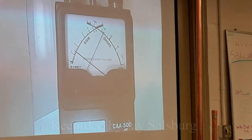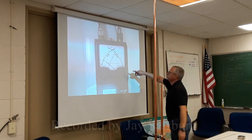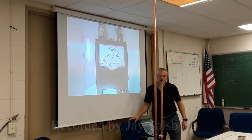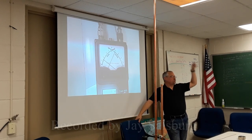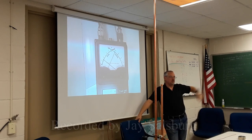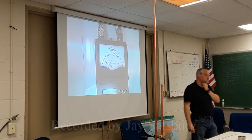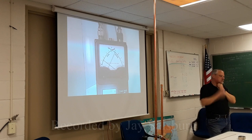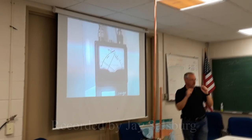And here's the deal, right? Now we're talking about the impedance, because we're at 75 ohms. So what is SWR? I have a resonant antenna. We have proven that. So why did my SWR go up? Mismatch between the antenna and feed line. Yeah, exactly. So this is the mystery for a lot of folks.